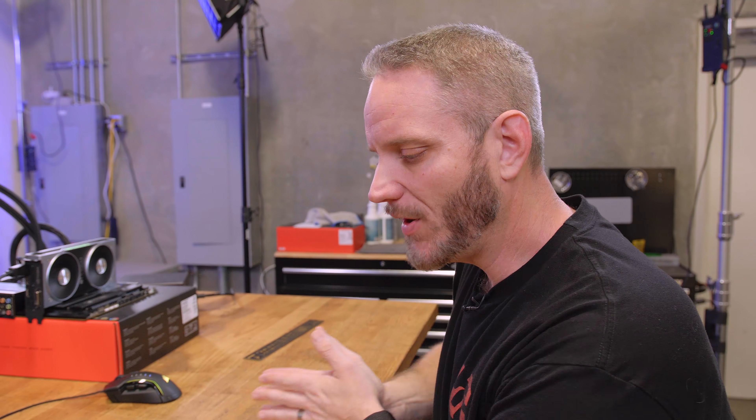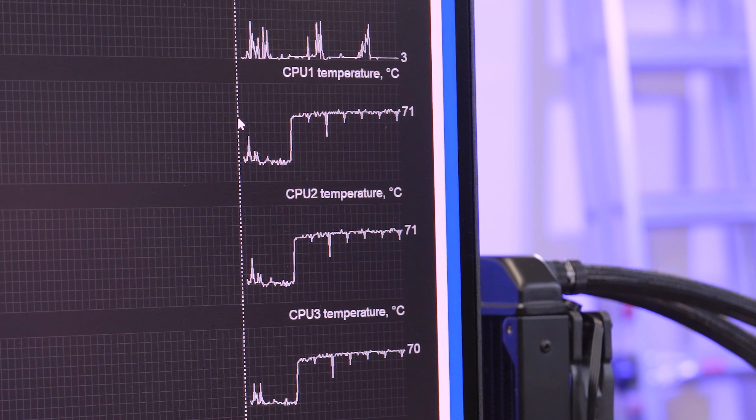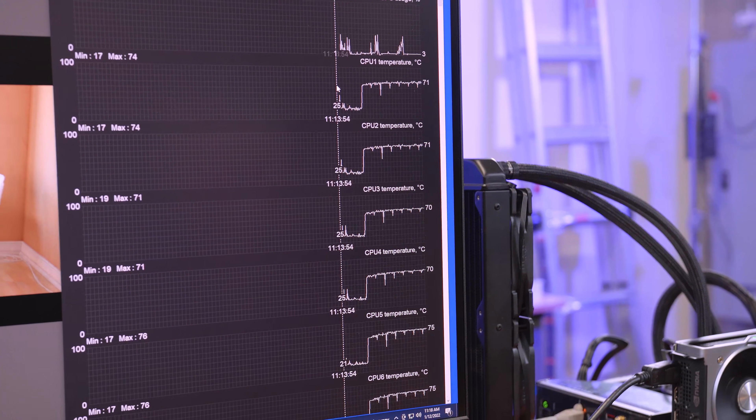Right off the bat I would say this is not a problem. And funny thing is I'm using the old hardware cranked down as hard as it should go, which is very tight. This is what I hate about articles saying XYZ is hot. When we did our 12th Gen video, people were messaging me saying it's so hot, it's super hot — why didn't you talk about temperatures? Because this is what we were experiencing. These temps I would not call bad. They're water cooled right now in the 70s — I don't even have the fans at 100%, they're at 75% — and it's just a basic Asetek AIO. When we did the 12th Gen test in the Corsair One and that was hitting 100°C, that's obviously because of the size of the cooler.